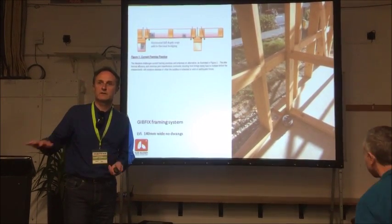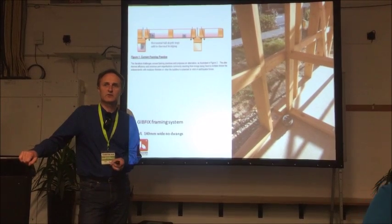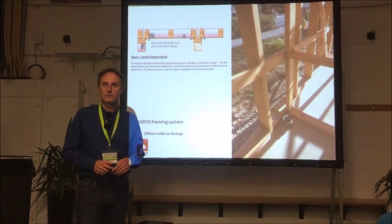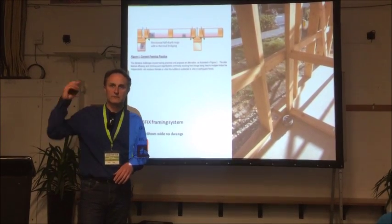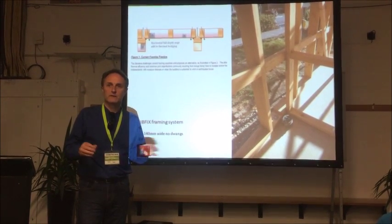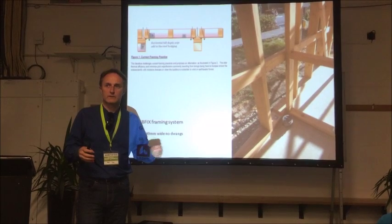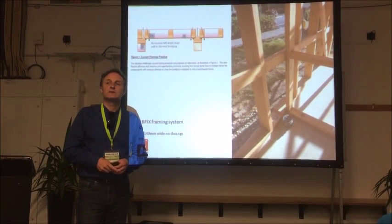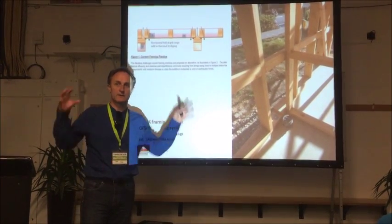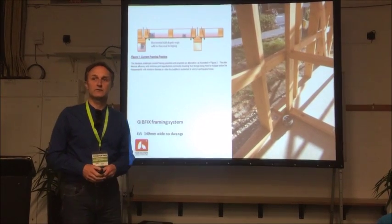The passive house I showed you took two and a half days to put together. The slab went down on a Saturday. The walls were made off-site in a factory — the roof panels, the floor panel for the mid-floor. Everything arrived on trucks. The windows arrived, the steel arrived. They started on Tuesday and were finished by Thursday lunchtime — they had the day off on Friday. That house just landed and went together in two and a half days.